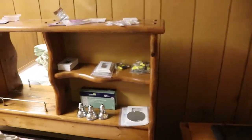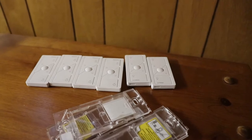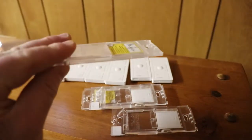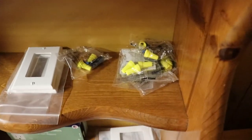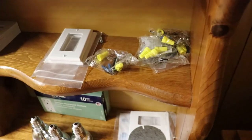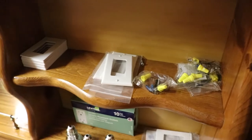You always get lots of these remotes, so you don't really need to buy any if you want to add three-way switches around your house, because you buy them in a pair to begin with. Some places will have three-way switches already and you'll use them, and some places won't. So you can add them if you desire to, or if you want to have the little pedestals. They come with lots of things here. I only use the screws, to be honest. And like I said, you can shorten these screws if you need to with your wire stripper. You just put it in there and snip it off, because sometimes you'll need them really short. We'll talk about the pitfall of the screw faceplates upstairs.